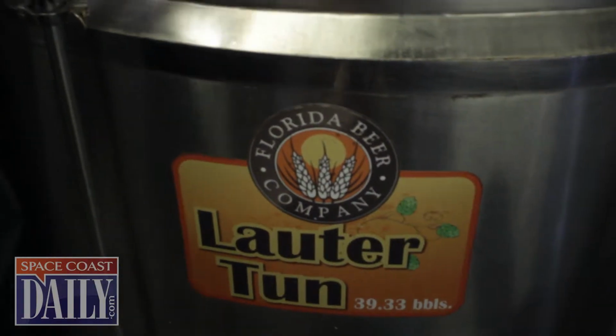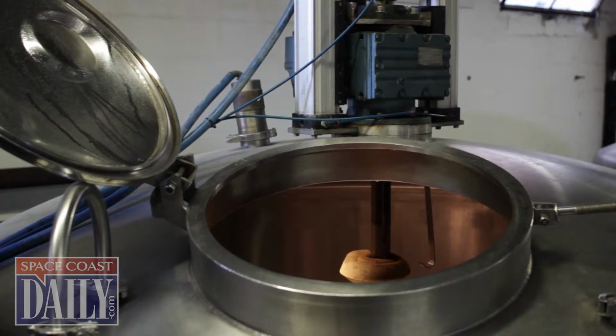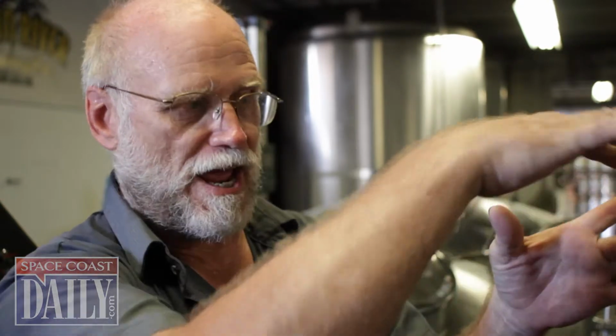And so we'll take that, and then you drain the liquid off of the grain husk. You leave the husk behind. That's usually used for animal feed. And this is a lauter tun here. So it acts like a coffee filter, where you've got the grounds in an element, and you just drain it through, and then you add more water, and you keep going until you get all the sugars out. You leave the grain, or the husk, behind, and you get it over into the kettle,